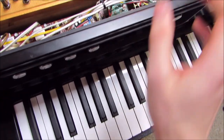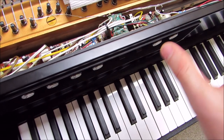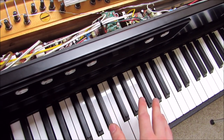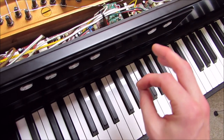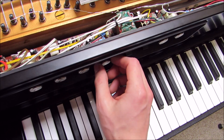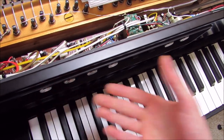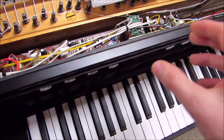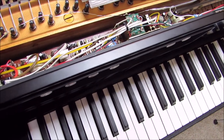Then you're going to want to let it sit for about 2 minutes. Don't turn it on. Make sure your piano, or any instrument you're working on, has no power going to it for about 2 to 3 minutes. Let it fully settle in and dry. Then you can turn it on and test the potentiometers, and if there's no crackling, you did a good job. If there is, you probably still did a good job, but it's just really messy. So you repeat those steps again and again until you get absolutely no crackling.